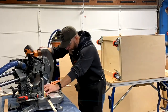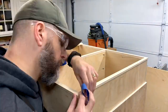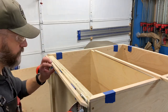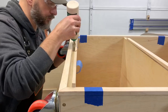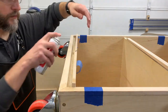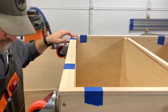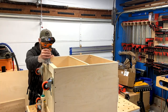I was really impressed with the results of this miter saw on this maple. Being at the bottom of the cabinet had a double layer of plywood, so I simply added in a second section of maple there. To hold everything in place, I used wood glue with a little bit of super glue in the ends and blue tape to hold everything down. After the face frame had dried, I used a flush trim bit in the router to clean up the edges.